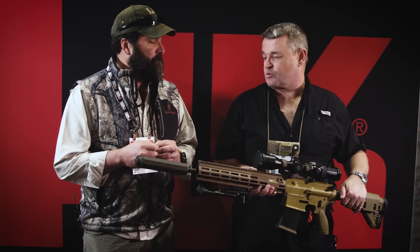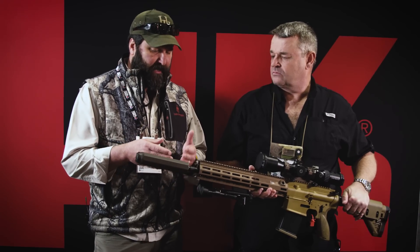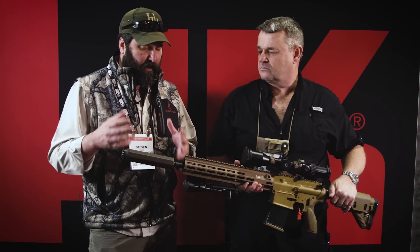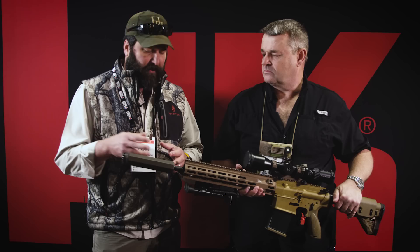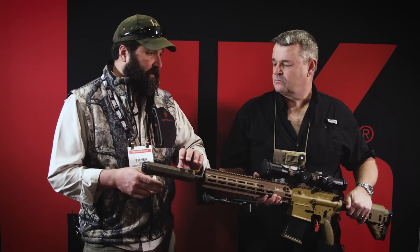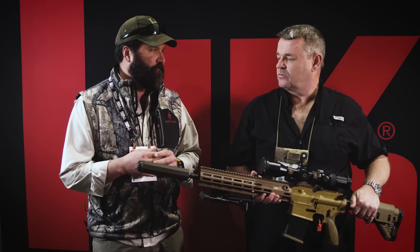Is it a rebuildable can? It is. The most important part of this can is the STS — it's going to take the most punishment — so the STS can be replaced just like any other muzzle brake. We're in the process with the ATF of working through how that's going to work for the civilian market. For the military market, the whole thing will be available and you'll be able to replace parts or pieces inside the can as needed for maintenance. The can has a 10,000-round lifespan with the STS, and when you replace the STS you basically restart the clock for another 10,000 rounds.